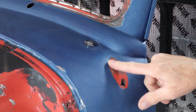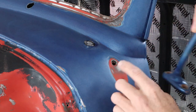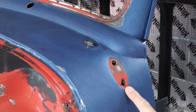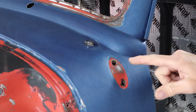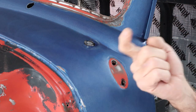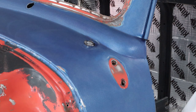Now the mirror mount right here — the mirror mounts right here like this. Somebody's pushed up on it and pushed the sheet metal down here. It doesn't feel like it's pulled up much here, it's just been pulled down when they wrenched up on it. Not sure how that happened, but we're going to fix it. So ideally, I'd like to push from the backside with a port-a-power while I tap around here, but I really can't get an angle on it to push. I'm going to try.